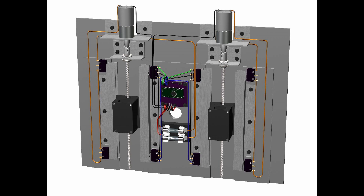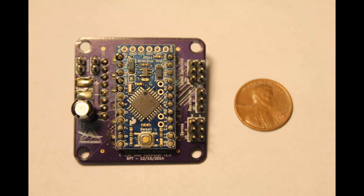I decided to redesign the whole thing. A friend of mine created a microprocessor that had drivers on it, giving me basically an electronic controller with a whole bunch of different inputs. This design is what ended up being in the finished aircraft and it absolutely worked perfect. My friend Berger de la Pena does controllers for me. Here's a picture of the controller — on the right you can see servo leads for up travels, down travels, and motor power from the drivers, and on the left hand side you can see where the actual motor leads went to power the motors.